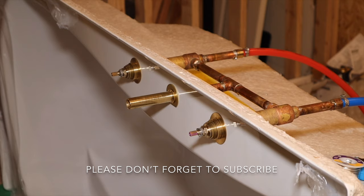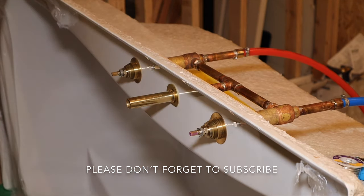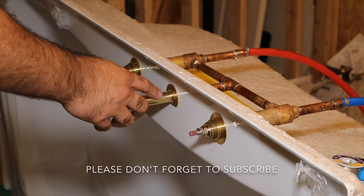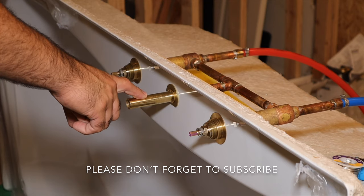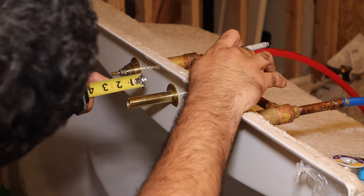All right, so the instructions say to do basically what we did, to remove the pipe plug and stuff. And then it says to cut off the spout supply here, an inch and a quarter above the rim, finish deck, or tile.